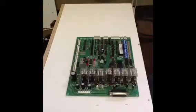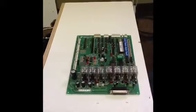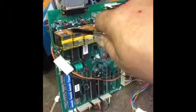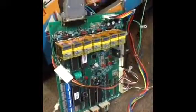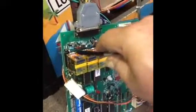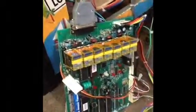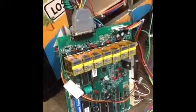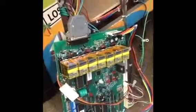When doing repairs, you'll end up with boards that have relays like these — these relays are removable, they're socketed relays. The other board has relays that are soldered in, so to get them out you have to unsolder them. On the socketed version, you just pop the relay out fairly hard — it undoes the hot glue — pull the relay out, move it over, move another one in place. That's the easiest way to test those relays to see if they're working. And that's the end of the boards.